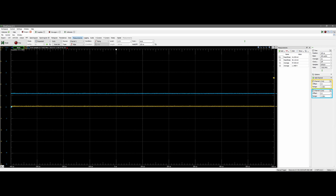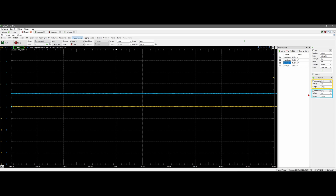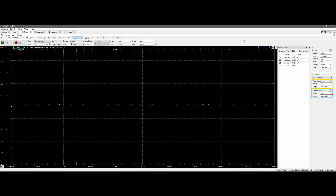The orange wires were in wrong — we want the negative, which is the orange with the white stripe, going into VB, and the positive going into VA. That makes sense because VA is the positive input of the instrumentation amplifier. Looking at the scope, the power supplies are turned off. We want to look at average values for C1 and C2. To get that measurement, go to Add, then Define Measurements, then select channel one or two, go to Vertical, and select from there.